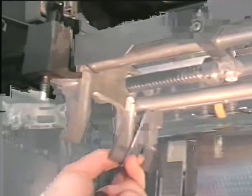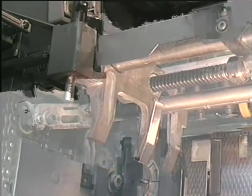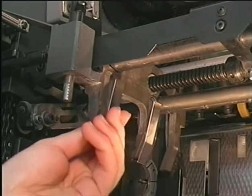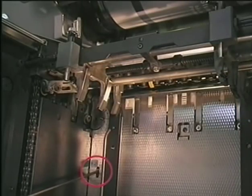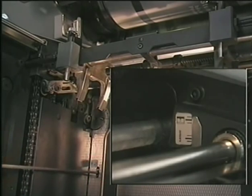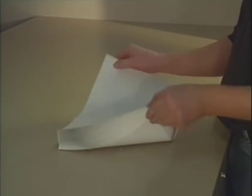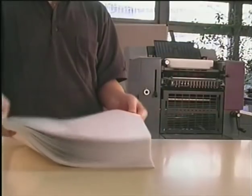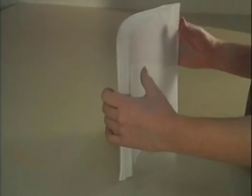Please slide the plate springs on this side of the lateral sheet guide pieces from where the sheet should be pulled away. You can now change the direction of pulling with the operator tool. In this example, we are changing the direction of pulling to the drive side. The stock should be loosened and aligned to provide for optimal sheet travel.